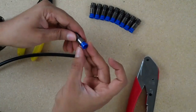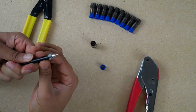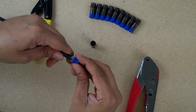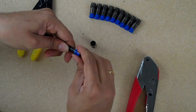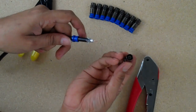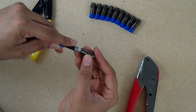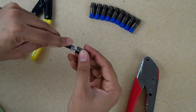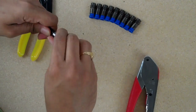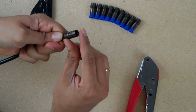Now take one of your connectors and just snap that off using sort of a breaking motion like you're going to break a stick — it should come right off. Put the blue piece on first, past the braiding of the cable. Now take the other part of the cable connector and work it onto the cable. You want this connection to go all the way until the inner conductor is flush with the end of the cable connection.